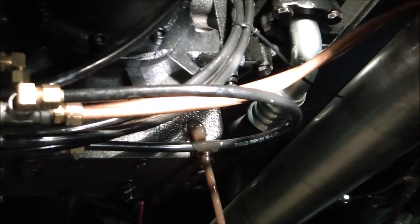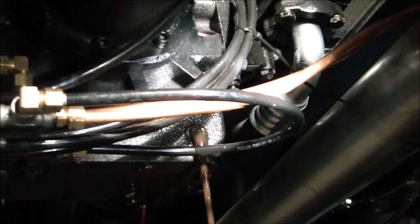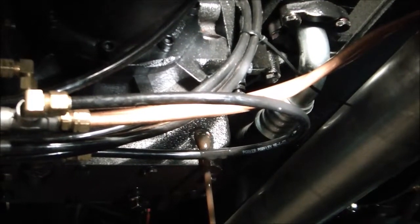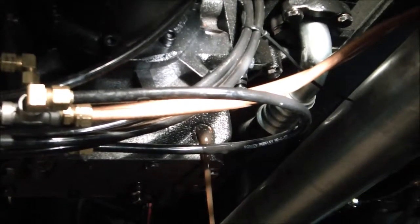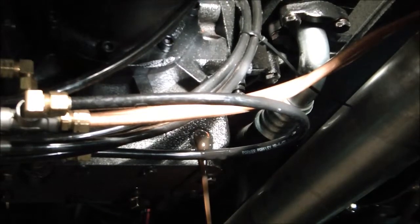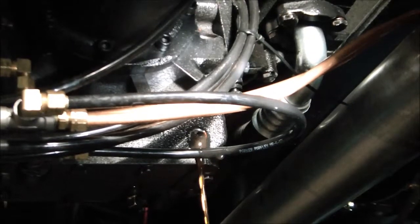It should be changed approximately every 50 to 100 pumping hours, and then also based on so many miles. This is the same gear case that will be rotating whenever the fire pump is running or whenever the chassis itself is just being driven around. So even if the fire pump is not being used often, this gear lube is still in the main drivetrain from the vehicle transmission to the rear wheels of the vehicle. So I would recommend at least once a year this oil be changed and replaced with new 80W90 gear lube.